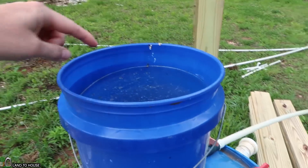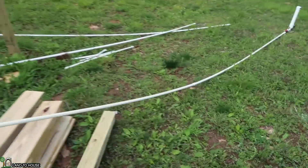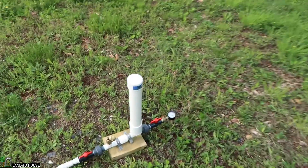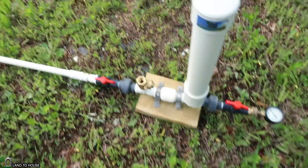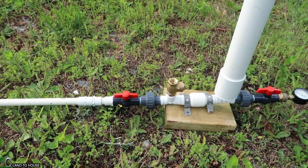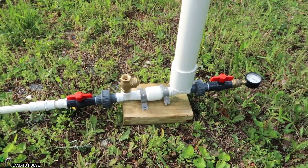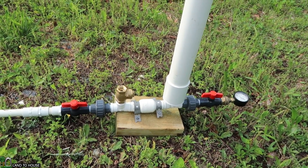Here's setup number one. I have the bucket full to a certain point. I've got a 20-foot drive pipe coming down to the pump — a half-inch pump. I've got a gauge here to read the PSI, and I also want to see the time on how fast the valve will cycle. Theoretically, the valve will go faster and faster as the drive pipe is shorter, and should produce less PSI in a certain amount of time. Let's start this up and see what kind of pressure we get with this longer drive pipe.